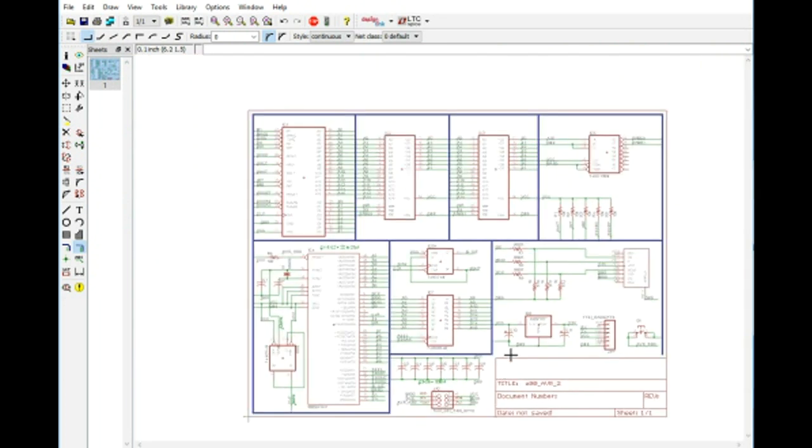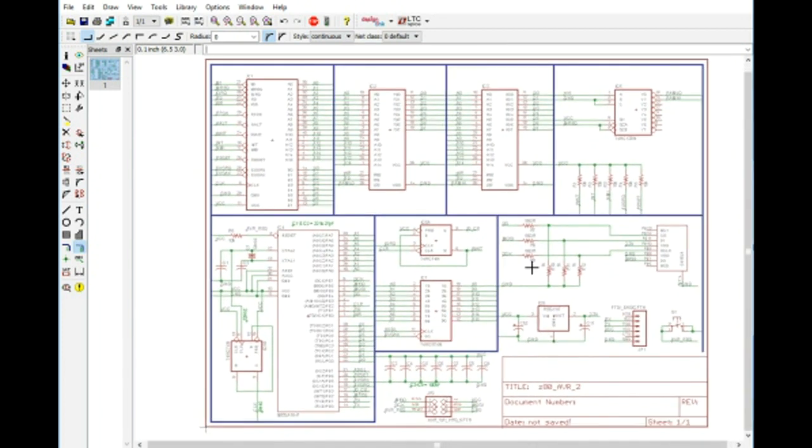And of course this is a little bit more complex than some of the other Z80 computers that interface with an AVR. But I think it gives us a little bit more flexibility. And yeah, we're adding a couple extra chips, but that's nothing really special. One of those is actually just a 32K RAM chip, because we're using two 32K chips rather than a 64 kilobyte chip. So that means that we're actually two chips larger. One of those is this latch for the upper address so that we can do DMA, which most of those other computers don't really have something like that. And so that means that we're really only one chip more.